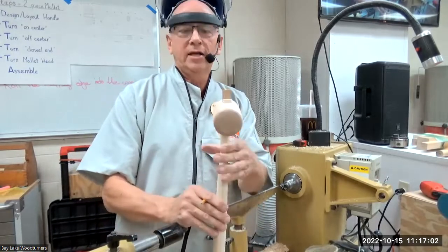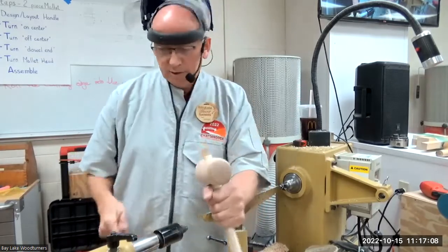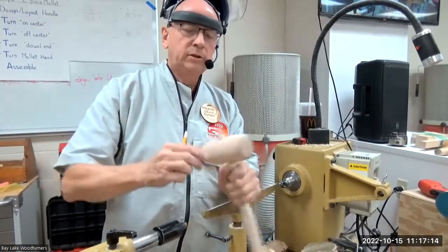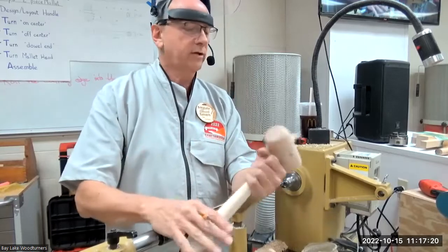You align the handle, tie the head, and put a little glue on the wedge. And then I'll just pound that down nice and tight. Drill a 1/4 inch hole through here, pop in a dowel. I'll cut this off on the bandsaw, and then sand it flush.